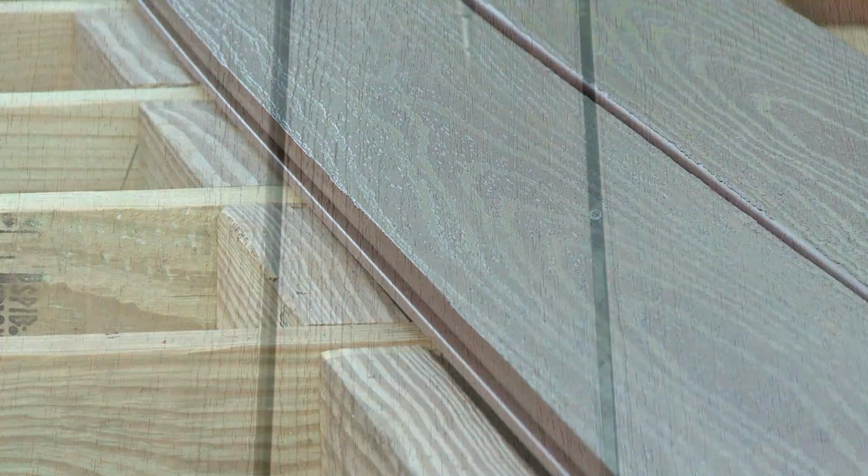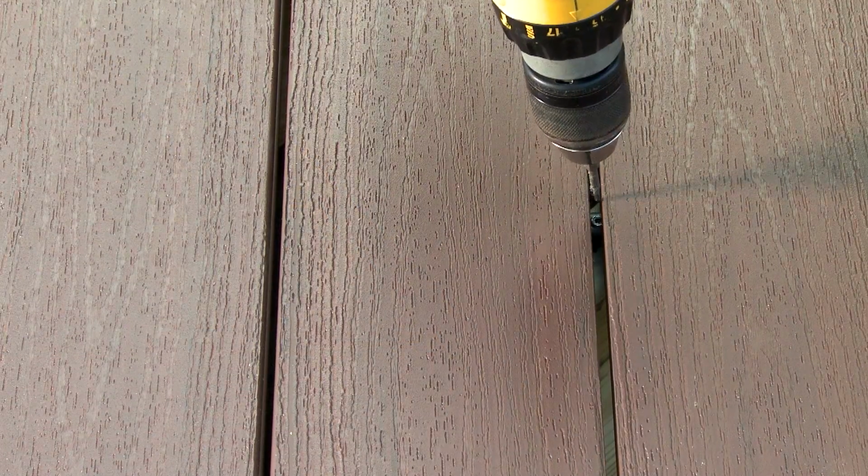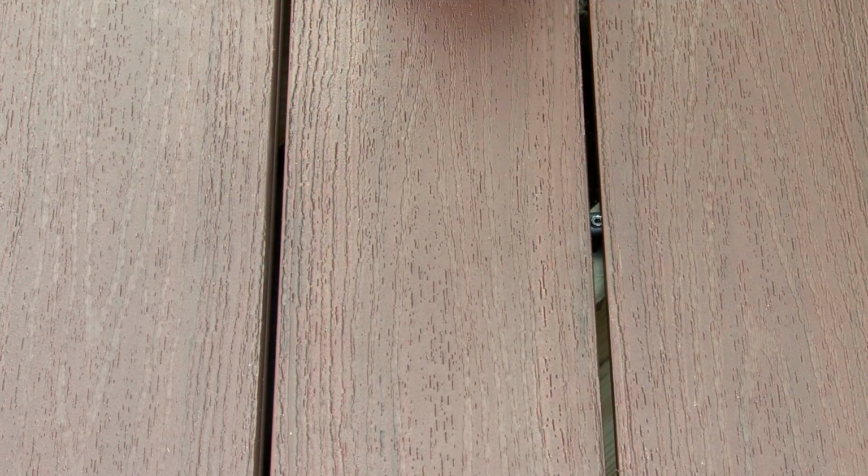When all clips are in place, carefully drive the fastener into the groove. Use a wedge to widen the gap between the deck boards. This will enable the heads of the screws to clear both board surfaces on installation. Once all hand-driven FUSIONLoc clips are secured, revisit clips in the grooves just ahead and behind, tightening the clips in those grooves as well.